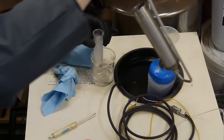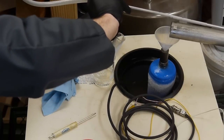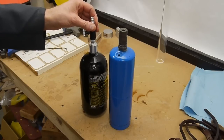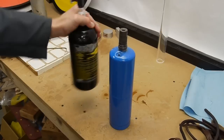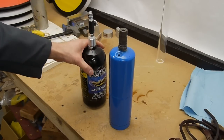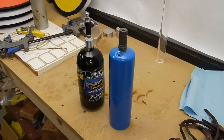While I was trying to figure out what to do, the freezer stopped working — at that point I had about an hour to find another container or release the ammonia somehow. I ran around the shop and found an all-aluminum high-pressure paintball tank, threaded it on the lathe as quickly as I've ever threaded anything, and transferred the ammonia into it. I couldn't find a definitive answer on whether aluminum is okay for anhydrous ammonia storage — I found conflicting references — so this won't be permanent storage. I'll probably use it up and then use the tank for something else. See you next time!